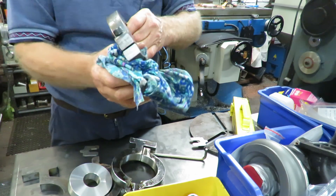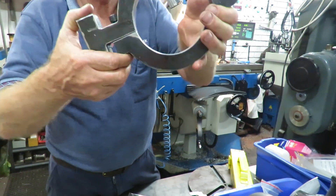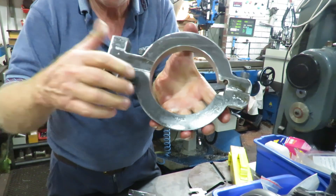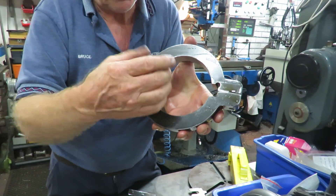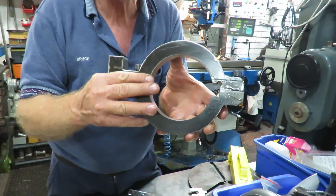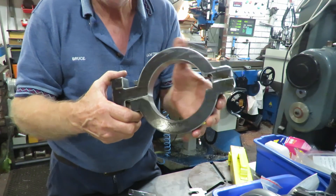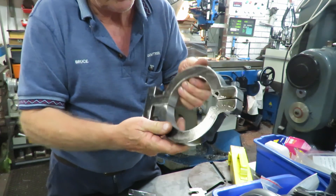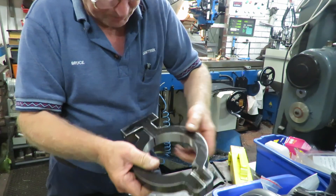I can demonstrate this on the single one. What I did was I clamped the thing together and proceeded to machine it. When it was going through about the fifth cut, I was looking at it and thought there's something wrong here. That's when I realised I was machining it to the exact diameter, but I really need the clamping effect — we need a bit of a gap here.